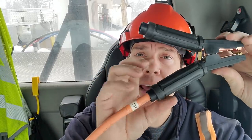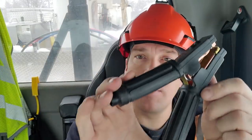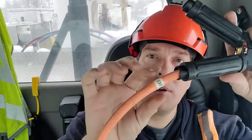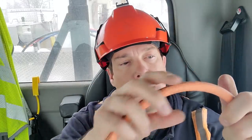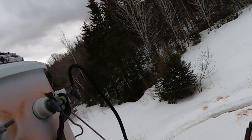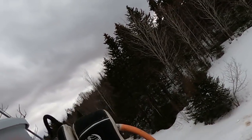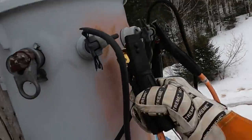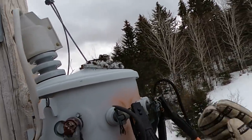First thing — these aren't a set of jumper cables bought at the local hardware store. They are put together at our service center; they have a proper crimp underneath the handle, and there's also a bonding strap inside so that regardless of what size the jaws are making contact, current will pass through the bond and into the number two copper wire. They are also tested annually — this one here expires July 2021. They are a regulated tool within our company with a written procedure.